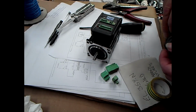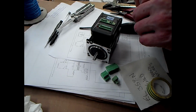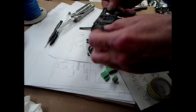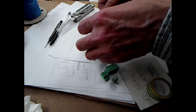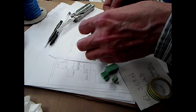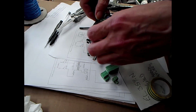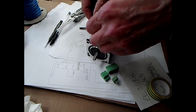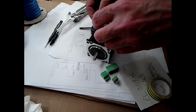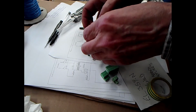The problem is the RAM isn't okay. It seems okay, but it's not. There has been a voltage drop on the chip. The voltage on the two flip-flop transistors from the 6 transistors that make up each bit of RAM has been reduced to a critical level. Any leakage or each read of a RAM location will suck out a little more voltage. Whether it takes a minute or 5 minutes, the program will fail.